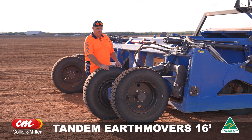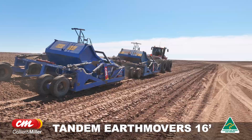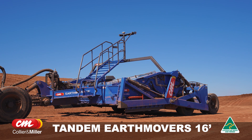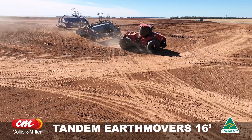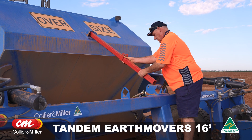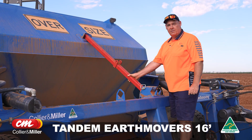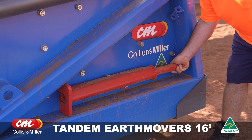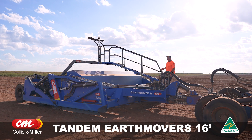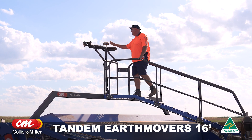The Collier Miller bucket has bigger tyre sizes and bigger heavy-duty hubs. We're finding the maintenance on these hubs and wheel bearings is basically non-existent — we haven't done a wheel bearing in about 8,000 hours on some of the hubs on the lead bucket. The ground clearance is higher than the competition and with bigger tyres we get better flotation in softer ground. Collier Miller have safety equipment including the bowl chock over the point, safety pins for the apron when you're inside changing cutting edges, and a safety ladder for ease of access up to the mast to change GPS equipment or check cabling.